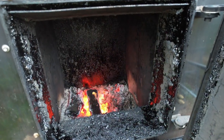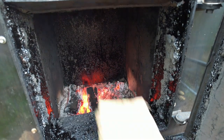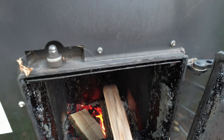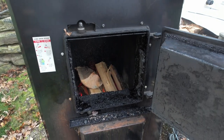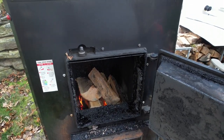This is a particularly small boiler. This Heatmaster likes 17-18 inch long logs, but there are models out there that you can put two foot long or even longer logs into. And since it's not that cold out right now, we don't need to load this up all the way. To get that 12-hour burn, we can fill the firebox up about halfway full, and that'll get us all the way until tonight.